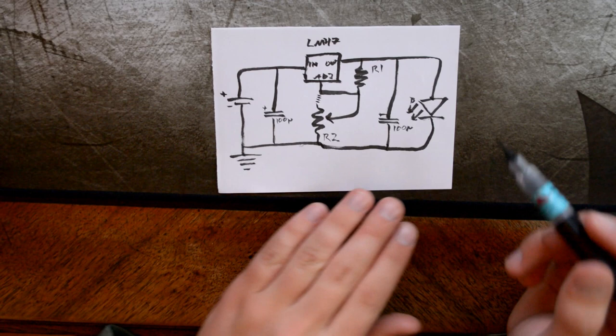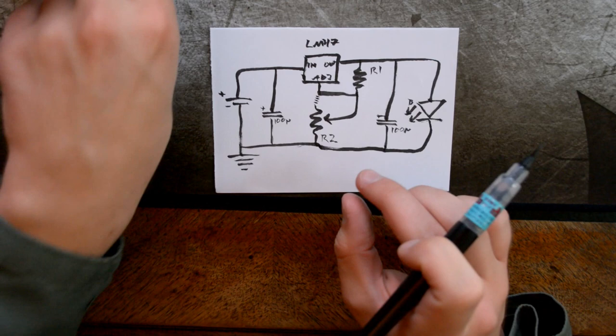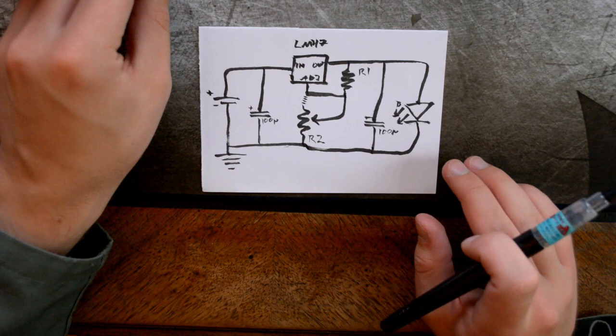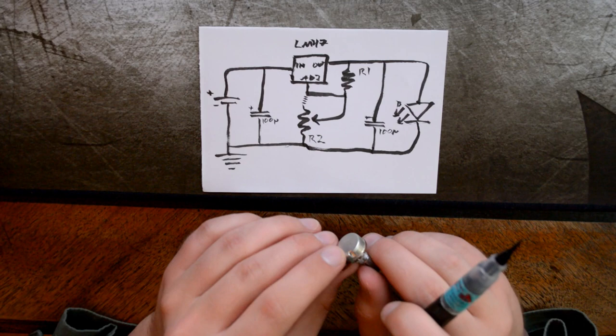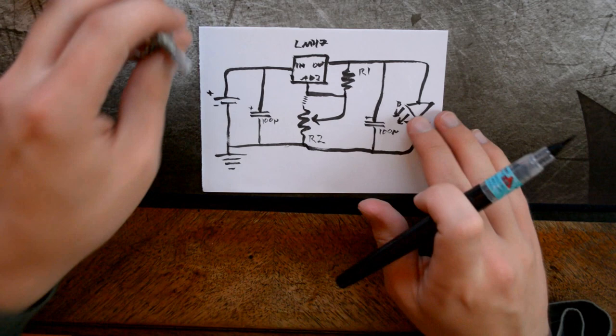And on this side also, it will keep the fluctuations of the regulating circuit a little bit more stable. If you do weird things with this one, it won't mess so much with the power supply for the LED. So if you have flickering problems and you didn't add a capacitor, it might be nice. And 100 microfarads, I'm sorry, I don't have a nice calculation of exactly how long it takes to discharge, because I don't know the power consumption of my LED. But some folks on Reddit that know about electronics thought that 100 microfarads should be good.